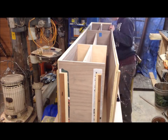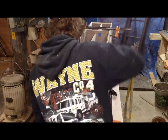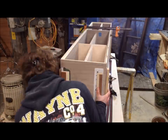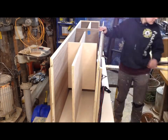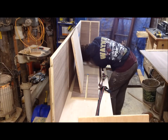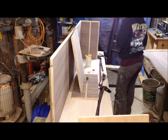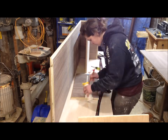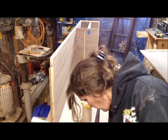I started fitting the whole thing back together, and since some of these are stop dados I had to take the top off to get them in. I knew the glue-up for this piece was going to be no fun. Even using Titebond 3, which has a longer open time than other glues, it was just going to be hard to do fast enough. So I decided to glue all the internal components together first, make sure they were square, and then glue the miters and the entire cabinet together.